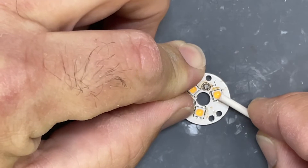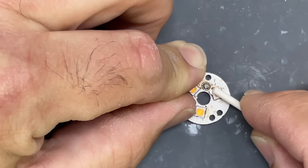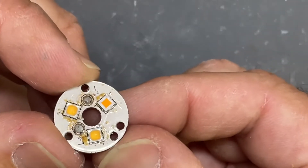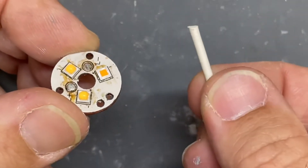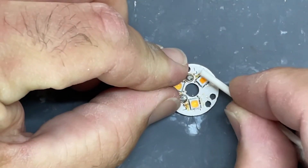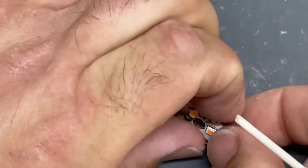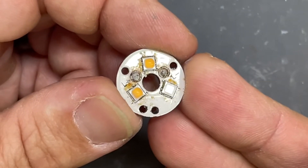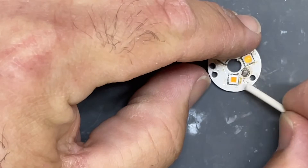Now that it's hot, you push real slow but even, and there's the dome — it comes off really clean. See that shimmer? It came off really clean, you can see it right there. But if you have to clean it up, you have the Q-tip. What I do even if it comes off good is go around and push from the inside out, because all the residual dome is on the outer circle. There's really not any on the glass — it's really good. There's a little bit on the outside but I don't go crazy.